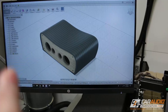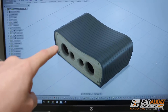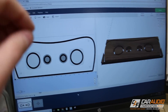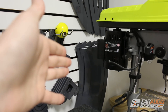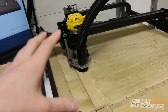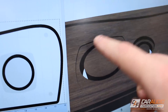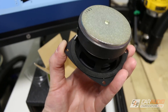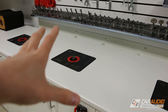Let's start doing some actual fabrication. Now that I have the design complete, we're out here at the car audio fabrication CNC center. We're going to start by making the front baffle piece that holds the two speakers and the ports. You absolutely do not have to have a CNC machine to make a complex shape like this — we could use different combinations of Mobile Solutions arc templates. But a couple of reasons I'm using the CNC: I'm actually making nine of these, and the CNC is great for production work. Also, zooming in on our part, you can see that flange around the speaker cutout — that's because I'm going to backload these speakers, and I want that flange to nest down in there flush.